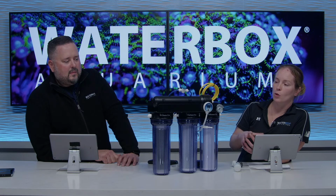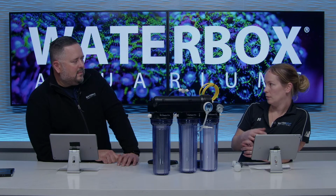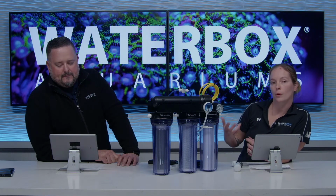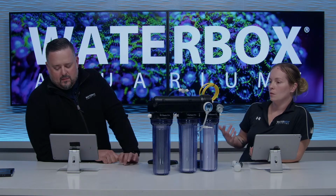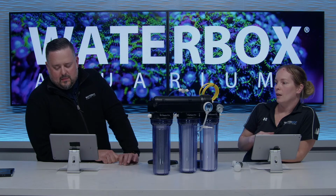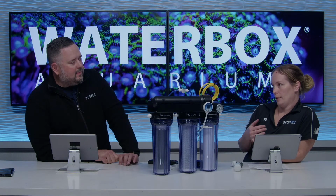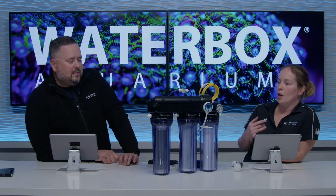The reason is the more pressure toward that 80, the more effective your filters will be. You're not going to have as much wastewater, and you're going to have a better output of good, clean water. So overall water waste is going to be less. At 40, that low point, you're going to be making a ton of wastewater compared to good water. So something to consider: there are booster pumps.